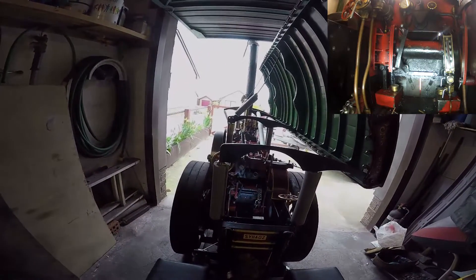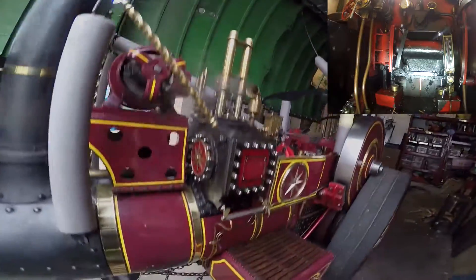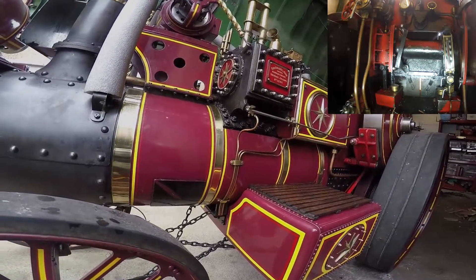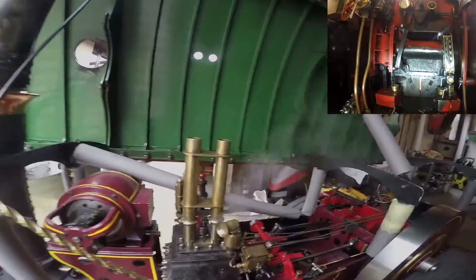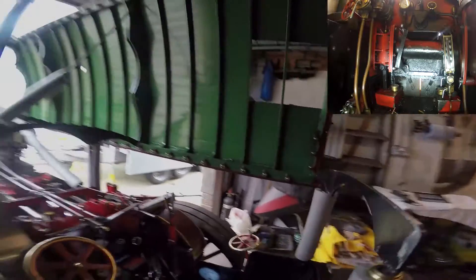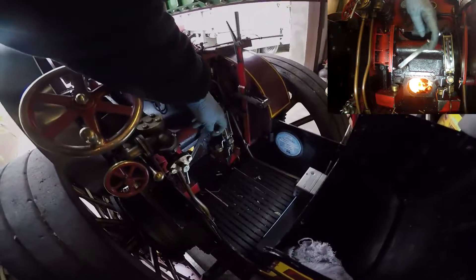So we're coming up on 90 psi now. Things are looking good. Things to check while steaming up: drains — nothing coming out of them. There are no leaks underneath, except the usual oily bits dripping off, as it is a total loss oil system. The siren leaks a bit until it gets a wee run, cleans its valve up, and seals up better. So the pressure is coming up nicely. Have a wee look in the fire — not too ferocious, but blowing along nicely.